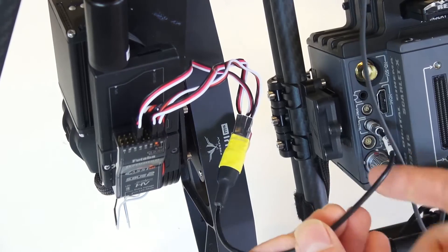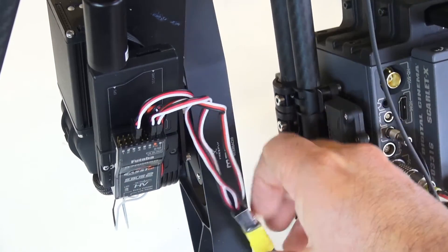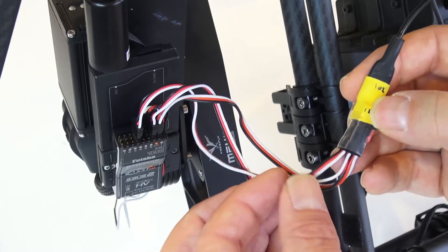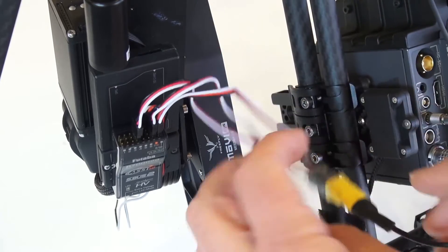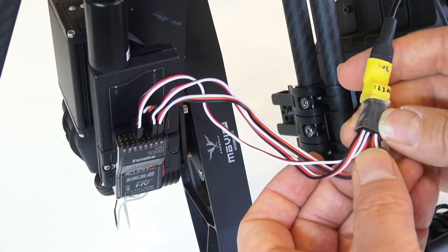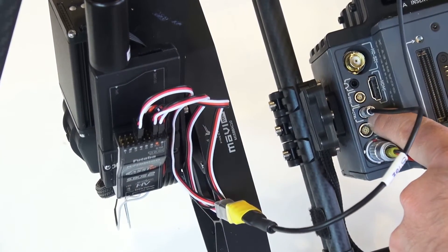This is our Gent wire cable, and this is the Red Pro — they call it the 102. I'm using the Futaba 7008 SB receiver. There are three servo cables labeled 1, 2, and 3. Cable 1 is the start and stop, mapped to channel 7 on the 7008 receiver. Number 2 was our iris control, going to channel 4 on the 7008. Cable 3 carries the Red remote functions coming off channel 8. This cable plugs into the control port on your Red brain.